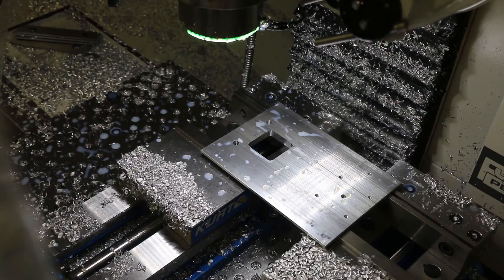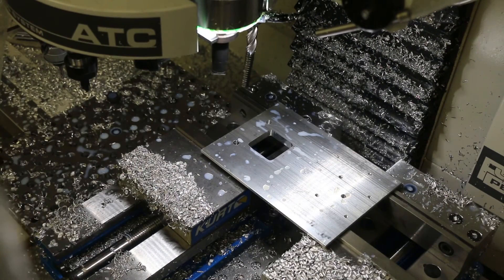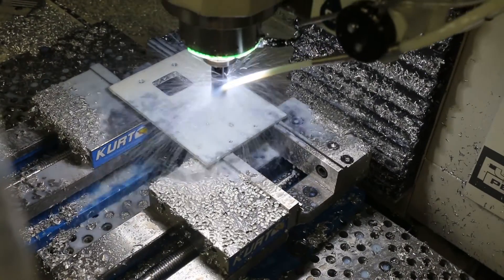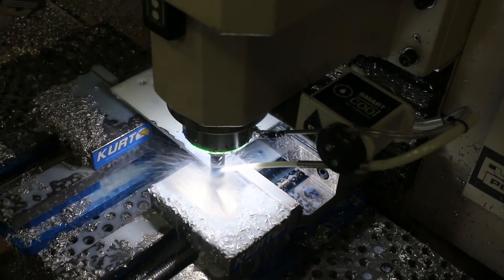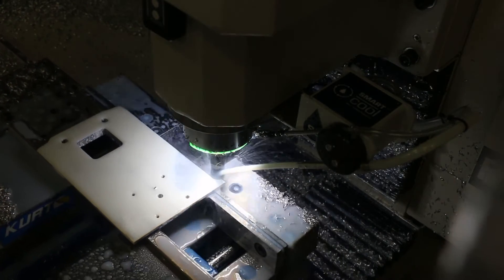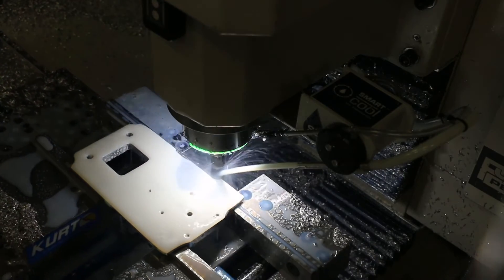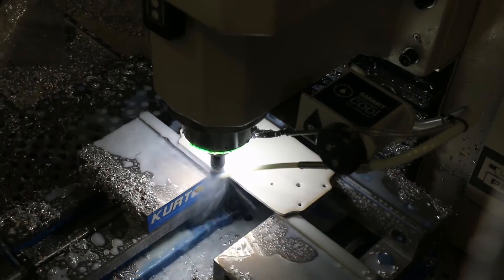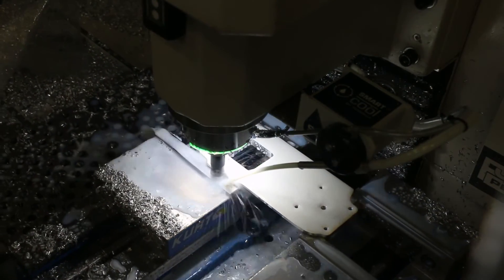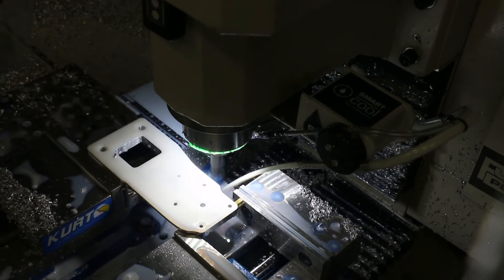Switching to the second side — these are all the same tools and basically the same operation, but this demonstrates the pressure drop issue I started to experience. Notice where the stream is on the shear hog in the starting position. You'll see it starts to drop off pretty quickly. It's getting lower and that's just the pressure — there's been no movement. In an operation like this where there's no plate for the coolant to drop against, that pressure drop can really be an issue.